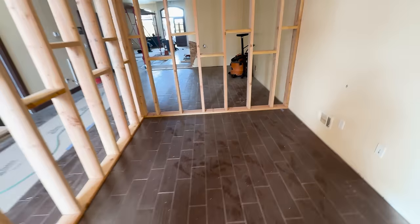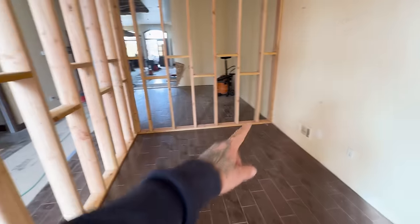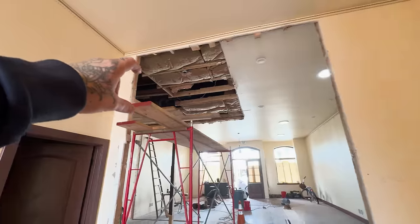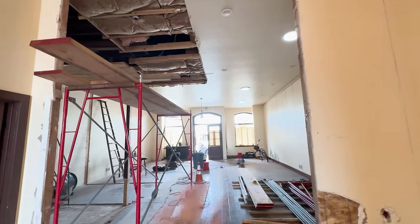We had to adjust for that. So we took 8 foot out of the corner this way, 8 foot out of the corner this way, and then on our construction calculator, calc the 8 foot rise, 8 foot run, and hit diagonal, and then taped it from there to there. Now we know that that's a perfect 90. We're gonna put a header all the way across here, continue down the 4x's all the way through, resheet this.